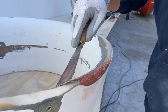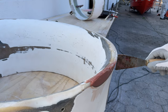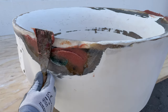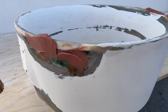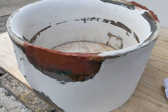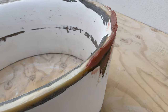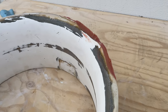While this fiber filler is more structurally stable than a typical base filler, you don't want it on the outside of your part in the end — if you hit it, it will just split off. That said, you need some contour to laminate the fiberglass on top of, so we're filling everything to have something to work with and a surface that after sanding is flat enough to laminate on. This is what it looks like after putting it on — a rough surface, but one that fairly closely matches the original nozzle contours. That's the first step.